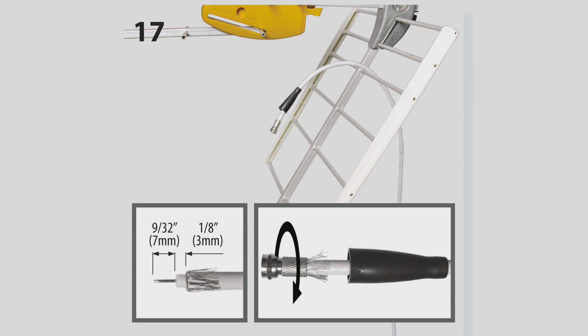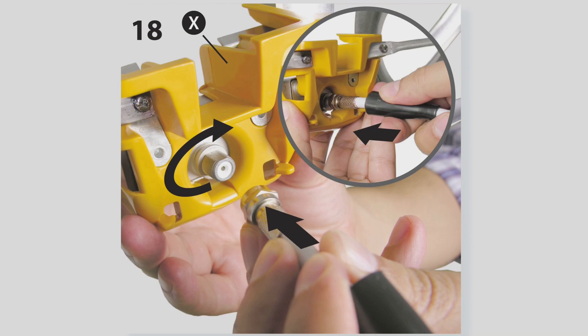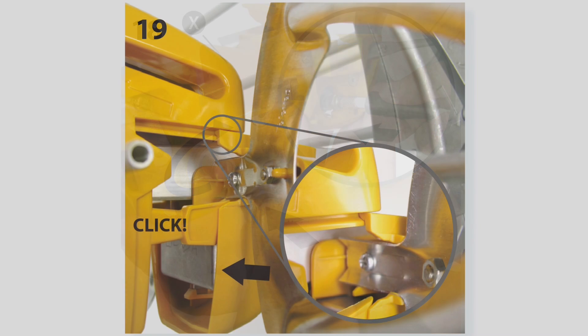For the rest of the video I'm relying on diagrams because you can't really shoot video on a rooftop with a regular camera. What the instructions are telling you here is to thread the cable in and prepare it to get connected. They do give you a screw-on F connector and a weather boot. If you choose to use regular cable you've already assembled, you'll need to supply a separate weather boot. The key point of step 18 is that you need to connect the antenna cable before you snap the cartridge in place — it's practically impossible to do it otherwise. Once you've got the cartridge and the cable attached, slide the cartridge behind the yellow plastic part and then slide it into place, making sure the little lips go right into the notches on the antenna body. When it's done you'll hear it click in place, meaning it's water resistant.